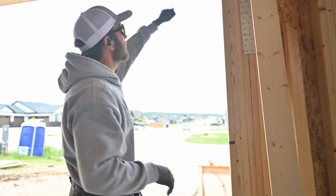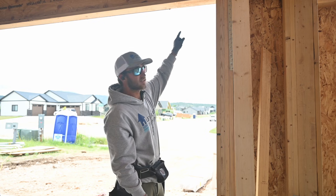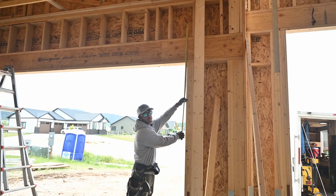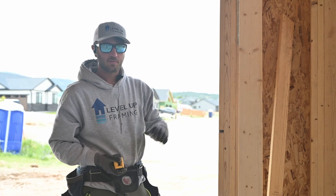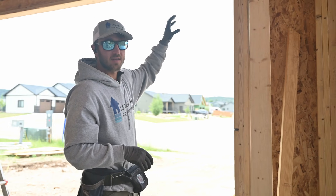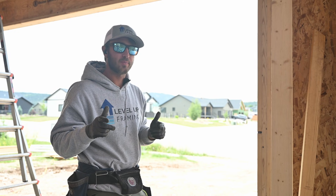This wraps the perimeter here, but we're also going to have each of these sideboards run up two feet past this rough opening, so it's going to stick up to there and then we'll stop it. Sometimes we run these boards all the way to the ceiling and leave it five eighths below for drywall, but in this case the general requested that we leave it two feet above. So ask your general or your lead framer what you're doing on your project.